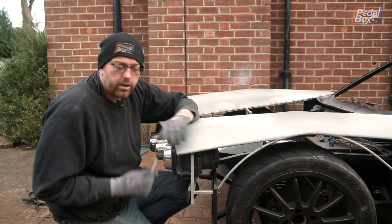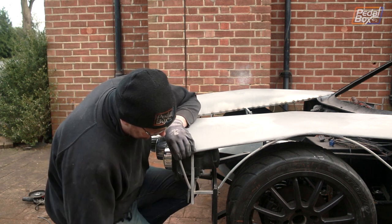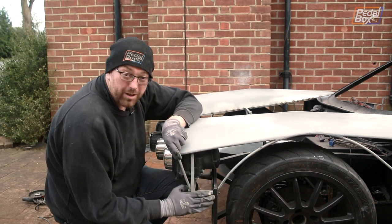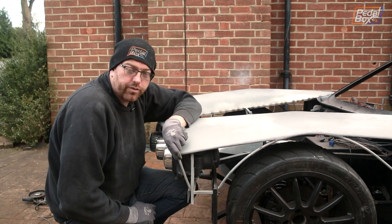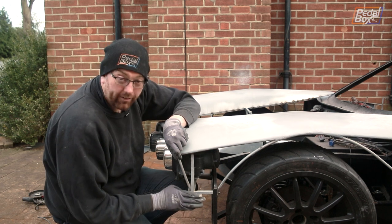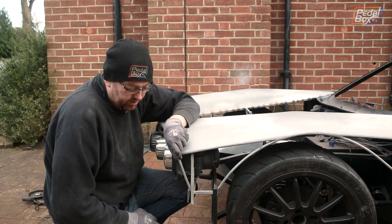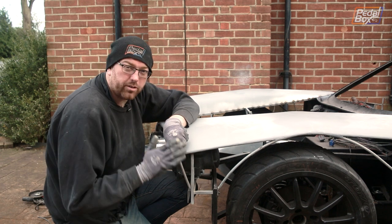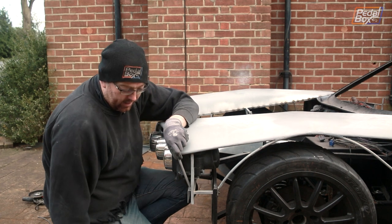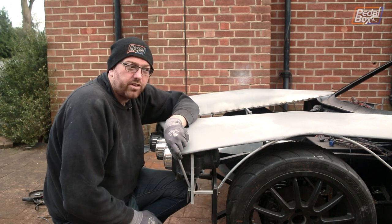This is the next section we're going to deal with in filling in the rest of this arch. The piece that I cut off from this side is actually going to fit almost perfectly right down there, and it will give us the frame to put a piece of bodywork that comes all the way down to this section here. Everything below this section is actually going to be attached onto this framework, same as the piece that comes around the front — it just makes life way more easy. There's not going to be very much coming around this section; it's basically just going to come down and attach onto this framework. I'm tempted to start a little bit bigger and do the whole side all the way down and just wrap it around and bolt it on there, because welding two sheets of flat steel right up against one another edge to edge is very, very hard.